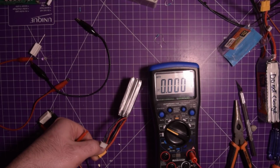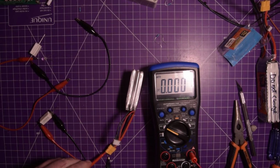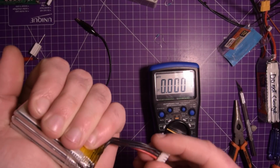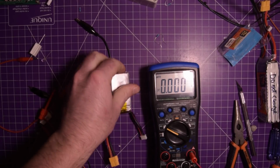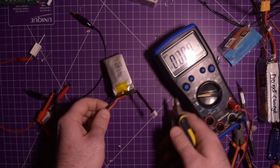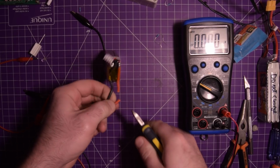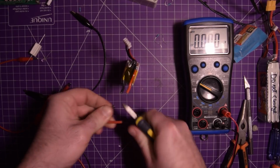so one there. I'll just kind of shove that in the holes. 1 and 2. Yeah, okay. No voltage left in there. Whatever's left is being dissipated through this link here. So that's good. Now technically I could cut these two leads at the same time because there's no voltage left, but I'm so used to doing it this way. You should never cut them at the same time.